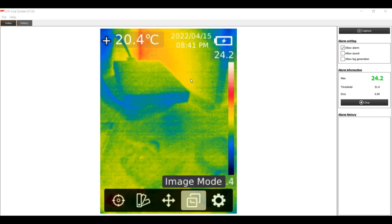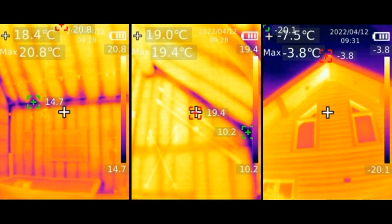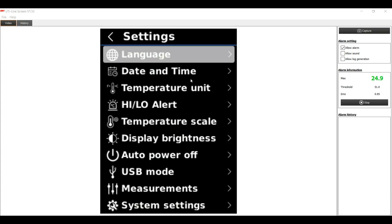Looking at the boiler photos: the 50% fusion overlay on the left shows some misalignment between the IR and digital camera images. In the center photo, the fusion alignment setting has been adjusted, bringing both images more or less together. The photo on the right shows the infrared image with no overlay. For house insulation inspection, the left image clearly shows studs in the walls and trusses in the vaulted ceiling. Cold spots are visible in the corner and along the top plate, and you can see heat loss behind the soffiting near the ridge beam.